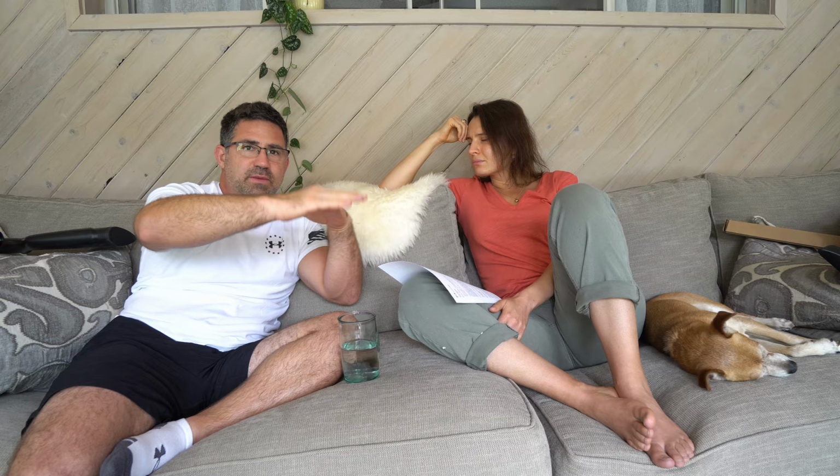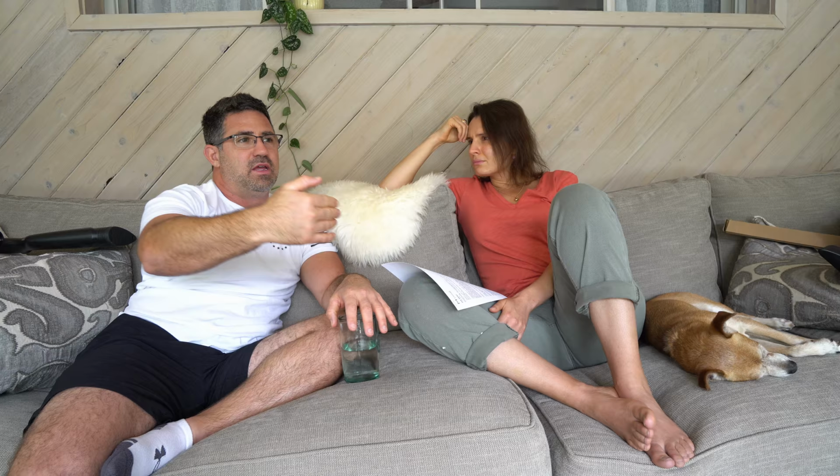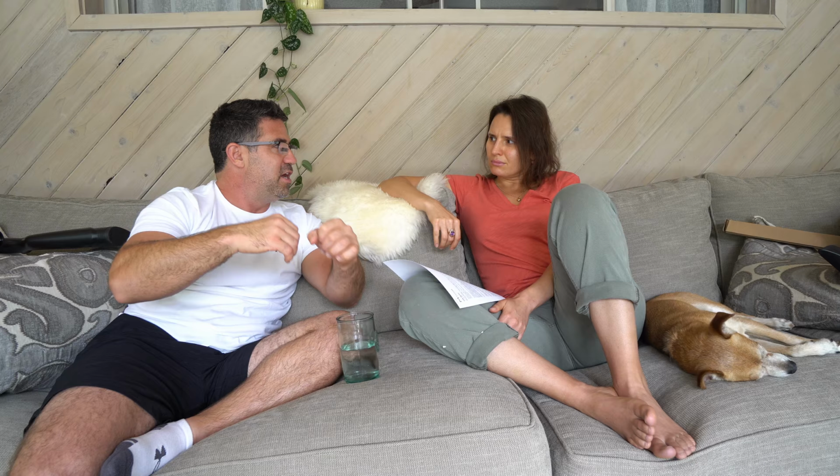Then all of those things get aggravated once the gun gets shipped to the owner. Now, wear comes into play. When the wedge starts to wear, when the mating surfaces start to wear, even when the O-ring gets a little bit more compressed on one end than another from use, you start getting changes in position. The bolt pivot starts to wear as you use it. The spring starts to soften behind the ball and behind the wedge.